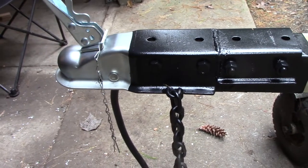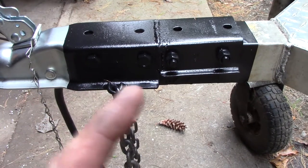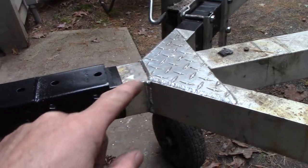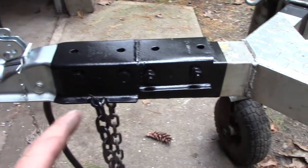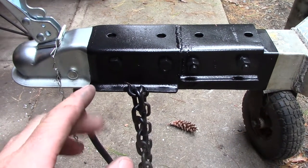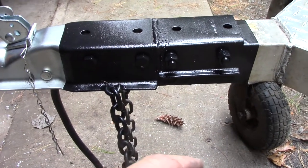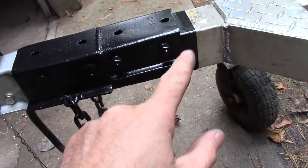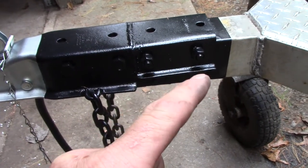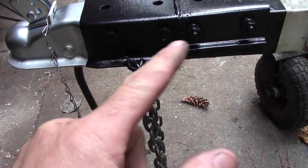So the tongue is done. The three-inch piece of wood fills this whole tube - goes back about two and a half feet of solid wood. That's the new coupler, and the old coupler I welded to the new coupler, put gorilla tape around the aluminum because that coupler is steel. And while I was at it I welded the chains on there too - just so I didn't have to keep drilling extra holes into the aluminum frame.